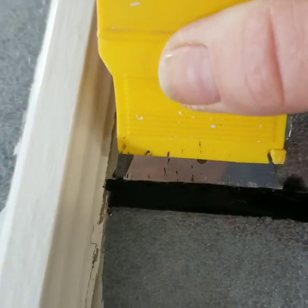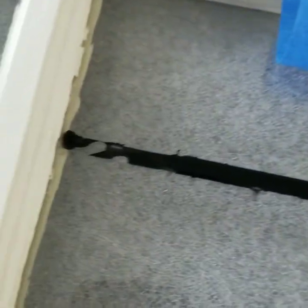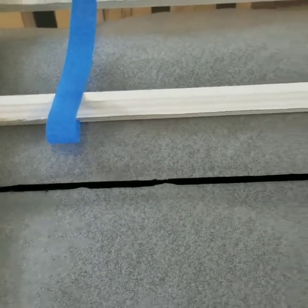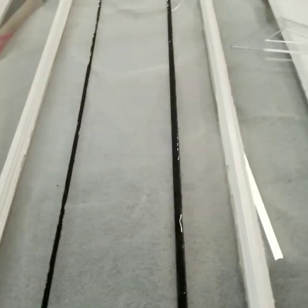You can see where it bled out a little bit. Taking your razor blade and pulling the glue towards your line, you can scoop it up, and then fill in any little voids with a little paintbrush, just dabbing it. I ripped the tape off the second side and realized I'd let it dry too much — it took too much of the paint-glue off. So I'm going to re-tape that line, add some more, and take it off a little bit sooner. You just have to watch it with your razor blade and keep pulling it in while it's still able to be removed. My first line came out really nice — I love that one.